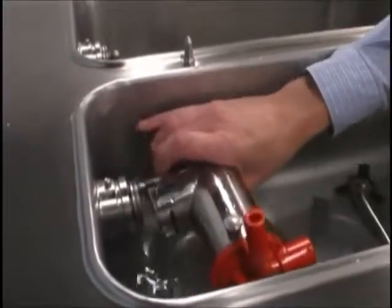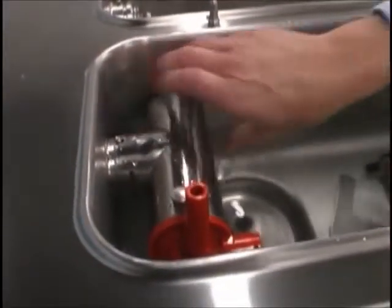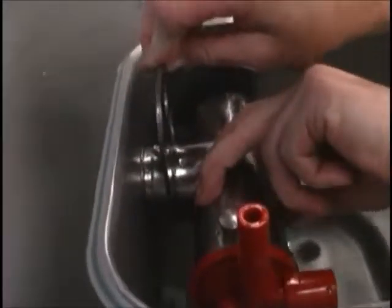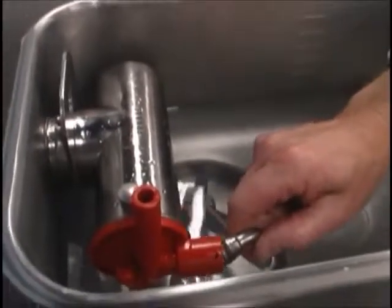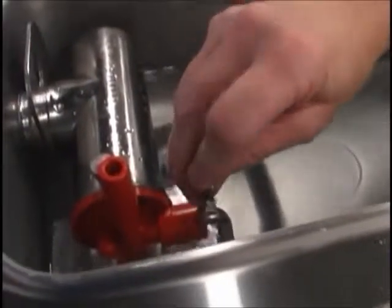Install the pump assembly at the rear of the mix hopper. To position the pump on the drive hub, align the drive hole in the piston with the drive crank of the drive shaft. Secure the pump in place by slipping the pump clip over the collar of the pump into the grooves in the collar. Install the pump end of the mix feed tube and secure with the cotter pin.